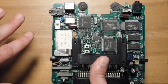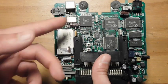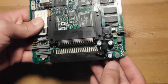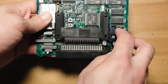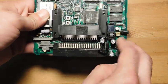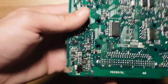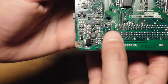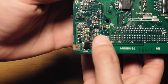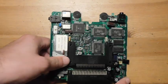It's much better if you just take your time, find the correct size and shape with the right capacitance and voltage, and put that in. Down here there are three caps and maybe a fourth one, and I have a feeling that all four of these are factory original. I'm going to flip over the board and take a look at the leads — they look like they haven't been touched.